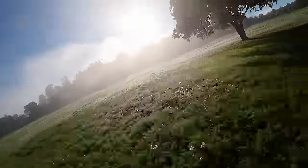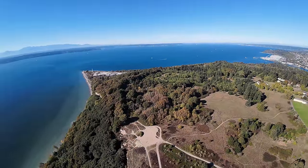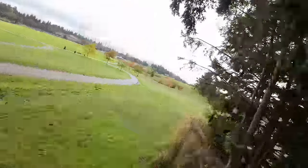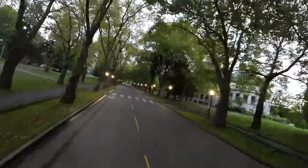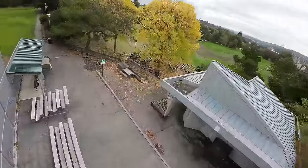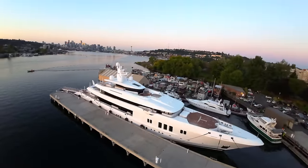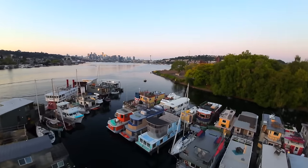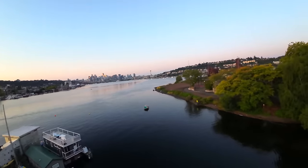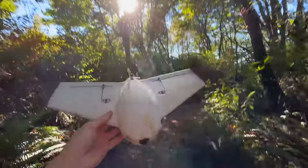The video you're watching is recorded on the O3. It's also sending video back to my FPV goggles and acting as the RC remote control link as well. It outputs an S-bus signal that goes into the flight controller. Kevin built up this plane with a 1206 brushless motor and a three inch three bladed propeller. One big challenge of using the DJI O3 in a little airplane like this is heat management — the thing overheats really easily. After powering it on you can't wait around very long before taking off and you need to mount it in a spot with lots of airflow. Kevin mounted his in the top hatch which worked out pretty well. My install was a lot less clean — I had it sitting in the base of the fuselage and ended up having to fly without the hatch for extra airflow. For my next build I'm going to put it up in the hatch or down in the floor with the bottom sticking out. For our CNC machined prototypes I had air intakes in the front but realized it wasn't really worth having them there since it makes the nose a lot less durable.